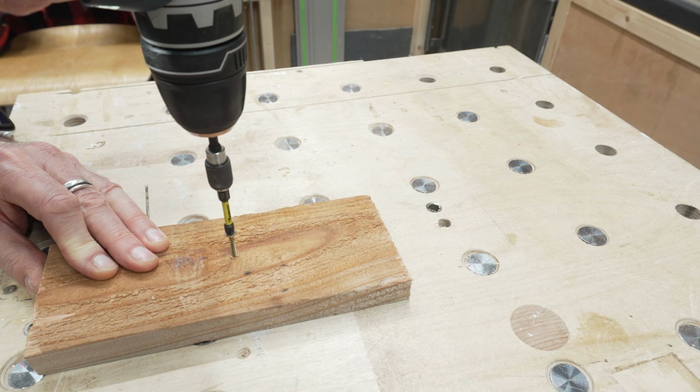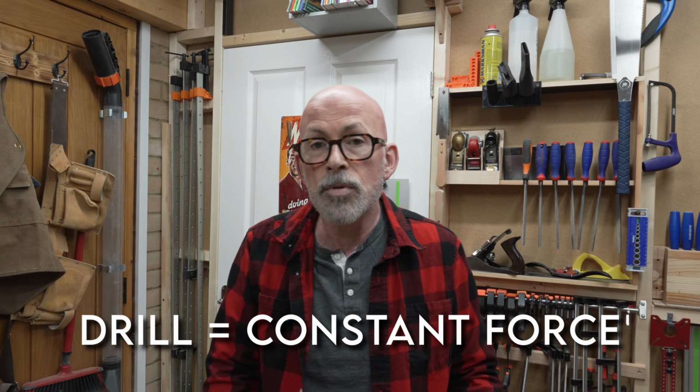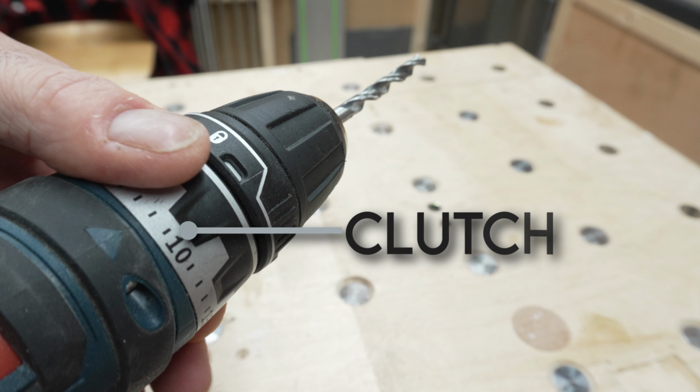I covered the drill driver in detail in another video, and I'll leave a link to that in the description. But for now, a drill driver is your all-rounder. It drills holes and drives screws using steady, constant rotational force, spinning the chuck at varying speeds depending on how hard you press the trigger. It also has a clutch which lets you dial in how much torque it applies, which helps prevent overdriving screws